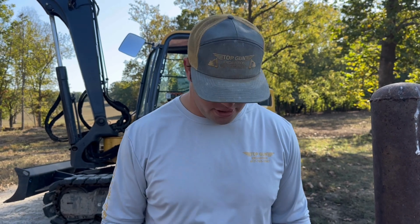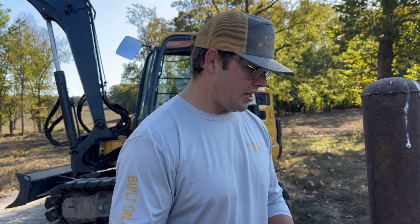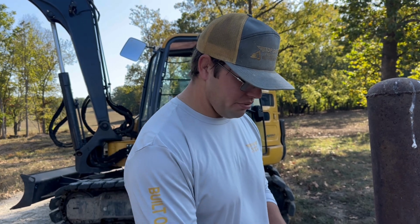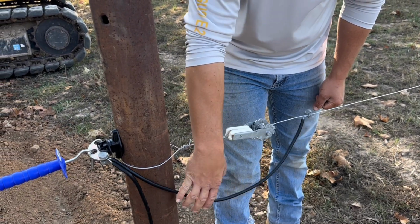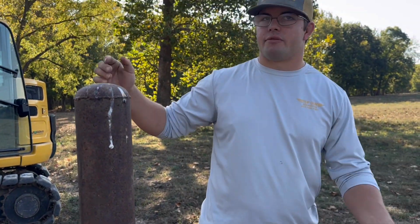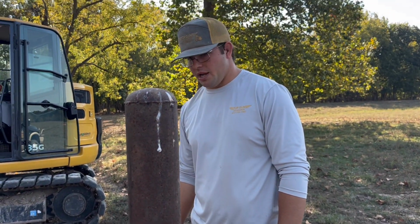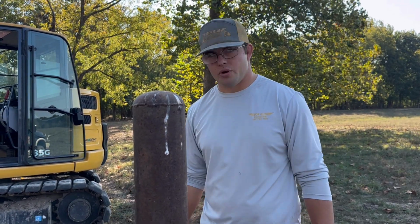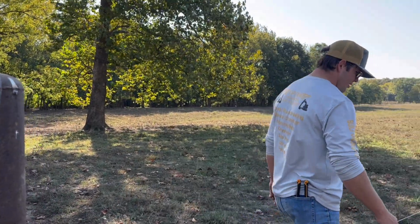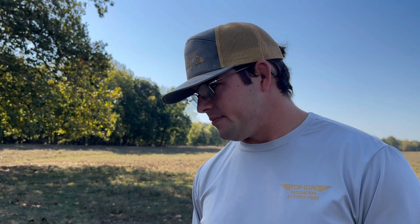Way more professional compared to what I've seen multiple other people do, because most everybody doesn't care about the cap. And actually I don't even think it's a rule that you have to use these bolts. It just has a better connection. Most everybody else will just wrap the wire around and call it good. Some people even use hot wire instead of the insulated wire between here. The bad thing about that is over time this thing will sag or get pushed in, and then it'll touch this post, and then you got ground out, so you got to go everywhere and make sure it's not touching. This is the professional exact way that you should do it, in my opinion. But to each his own, you can do it however you want. This is just the primo way, the maverick way. That's it. We'll show you guys the backfilling and show you the after project afterward after it's done.